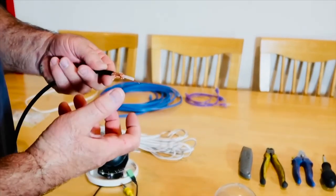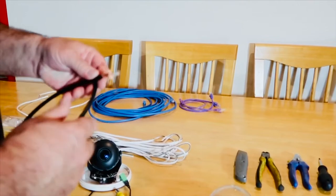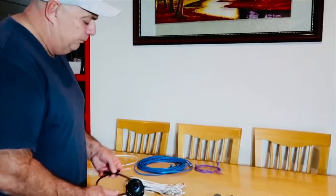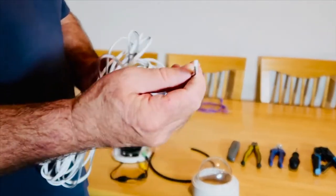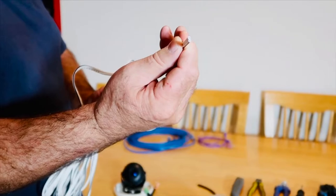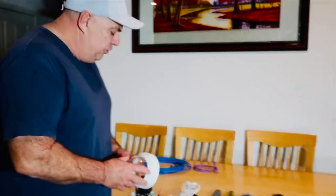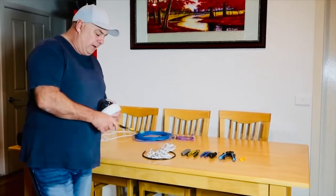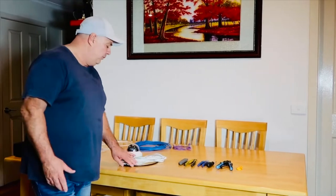You can buy pre-connected cables with kits — you can still buy kits where you get a digital video recorder, a number of analog cameras, and also the cables. For the power supply, there's a cable called a figure-eight cable. It's two cables laying side by side, and if you cut it and look at it end-on it's in the shape of a figure-eight, which is why it's called figure-eight. Analog cameras are still available, quite cheap, and you can get pretty good quality out of them, but for the purposes of this series we'll talk purely about IP cameras.